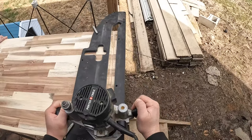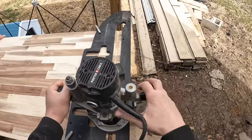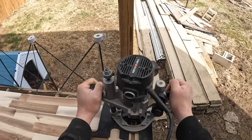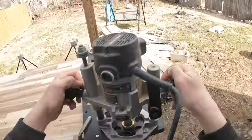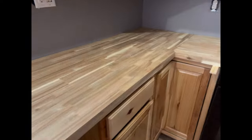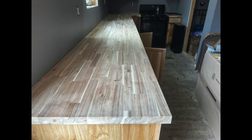Here we are cutting the male side, and on this joint the male side has to be cut upside down. I look at the owner's manual when I'm doing these countertop joints — sometimes I look it up online — just to make sure everything is oriented correctly when I'm cutting. We'll be cutting the sink in next. I used a track saw to cut all the straight cuts.